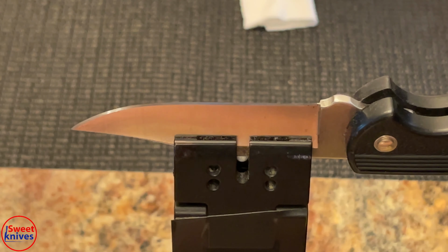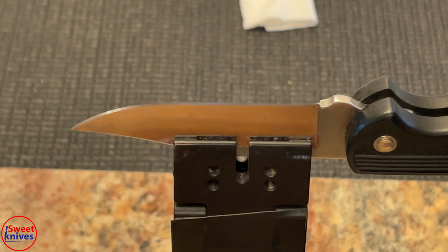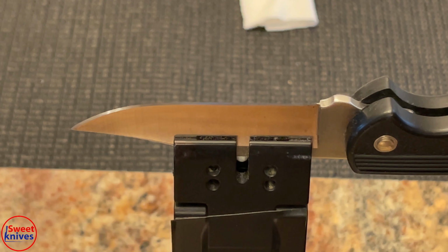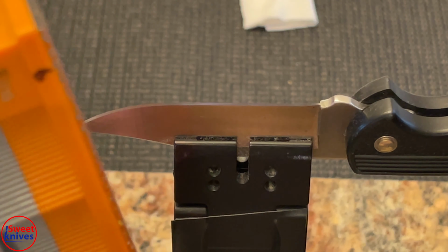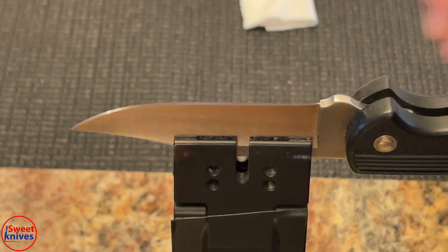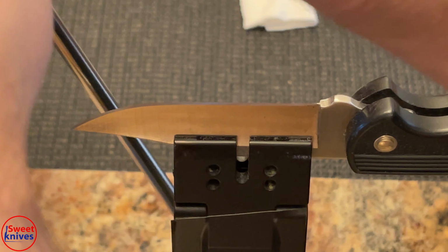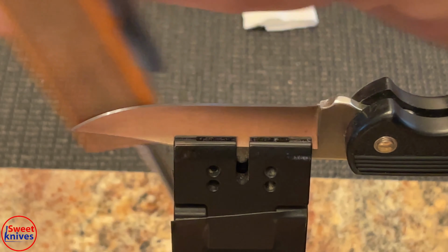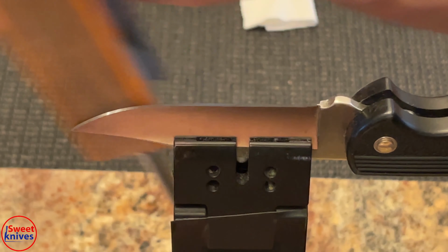Now guys, we're on to the diamond lapping films. So we're gonna start with 6, because that's what I got here. Micron, that's 6 micron on this deal. And that's what they kind of look like. And this time you can only go out like this. You can only go out, because if you went in, you'll cut right through that lapping film.